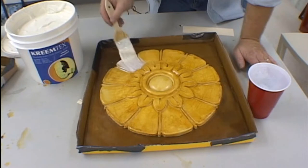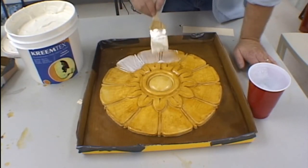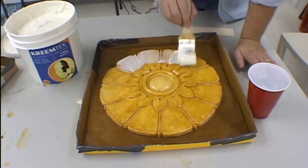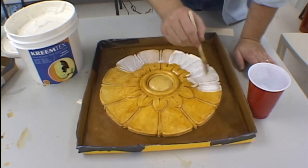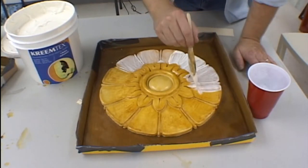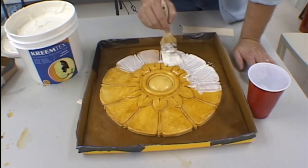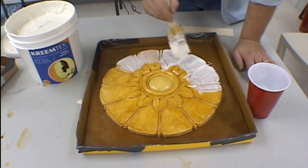As this is your print coat, which is the primary coat which captures all the detail of the model, it should be brushed on very thinly and allowed to dry completely. During this, make sure that you do not puddle any latex in the little cracks and crevices in the model. This has to go on nice and thin and will build up and fill in all those cracks and crevices during the molding process.